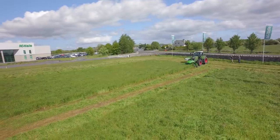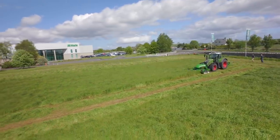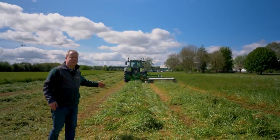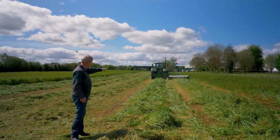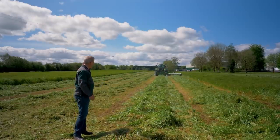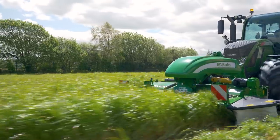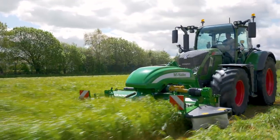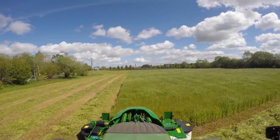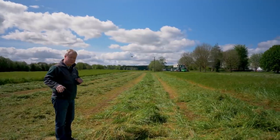With the mower open on both front and rear, you can see the difference — the full width spread in the row gives the grass a chance to wilt. You can see the flotation on the rear mower as it travels forward, with left-to-right and forward-to-back movement. It's a simple adjustment to give a different option when mowing. We'd recommend about 150 to 160 horsepower for the front and rear mower combined — ideally 75 to 80 horsepower per bed. Both machines are controlled by spool valves in the tractor and are in float position when cutting.